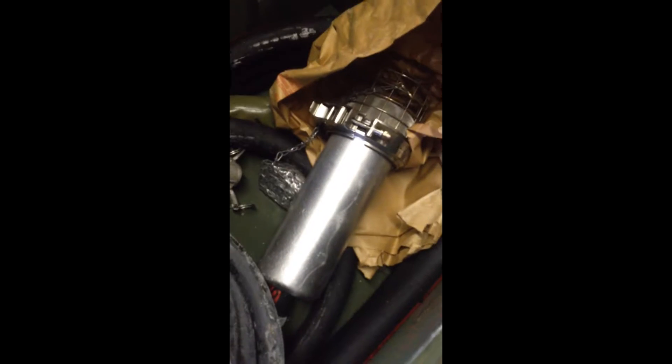This is the strainer. You can hook up either two wands or one wand and the soap mixing device, which you see down in the bottom there — it's kind of a weird gizmo. This is the large suction apparatus — it's got a pretty large hose on there, and a nice screen with a larger screen on the outside and then a finer screen underneath. That's designed to go into your water source, whether it be a tank, pond, stream, or whatever. Then you have an air pump to pump up that bladder I was talking about earlier.